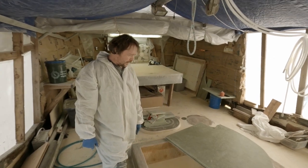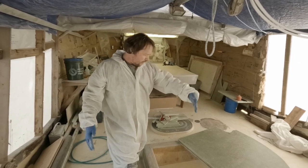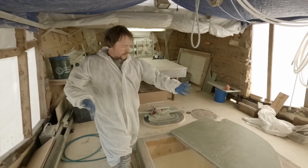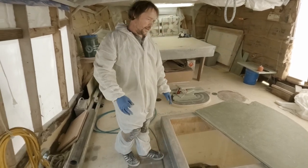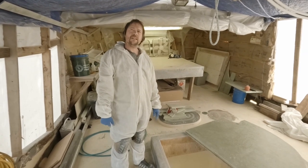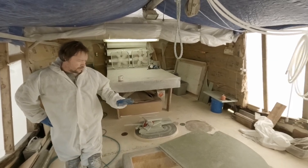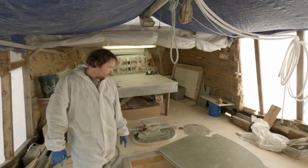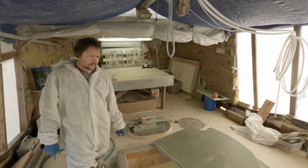We'll probably put a brace in outboard of the bin board holders, and so we'll have two on each side and then probably pull one right in the middle. Of the shaft alley, so five total. And that's gonna be somewhere on a 20-ish, 24 inch center, I suppose. At any rate, those will be on each side of it, so it'll be very, very strong when we're done. That's how you add a lot of rigidity to things like that. It's just like the framing inside of a house, essentially.